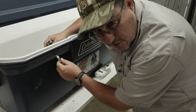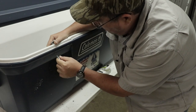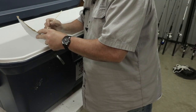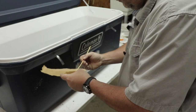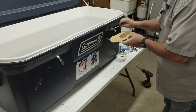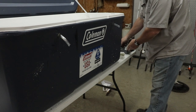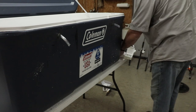I'm going to mix up some more epoxy and go around the outer and the inner connection. Then we'll come back after that cures and trim that off. While we're waiting on that to dry, we're going to take a 9-64ths bit and pre-drill these bubble boxes.